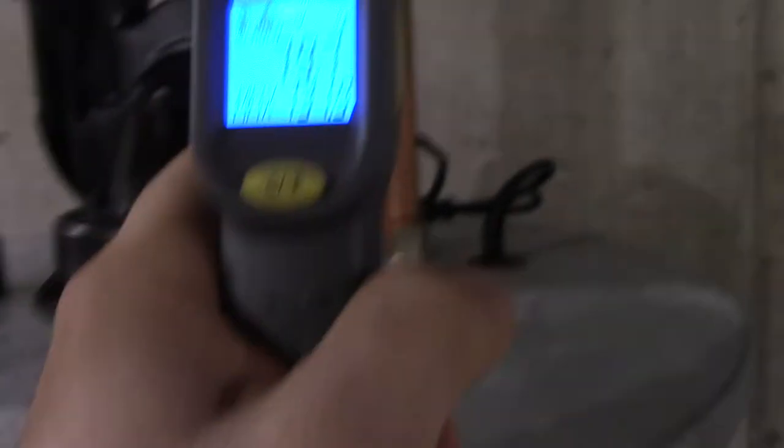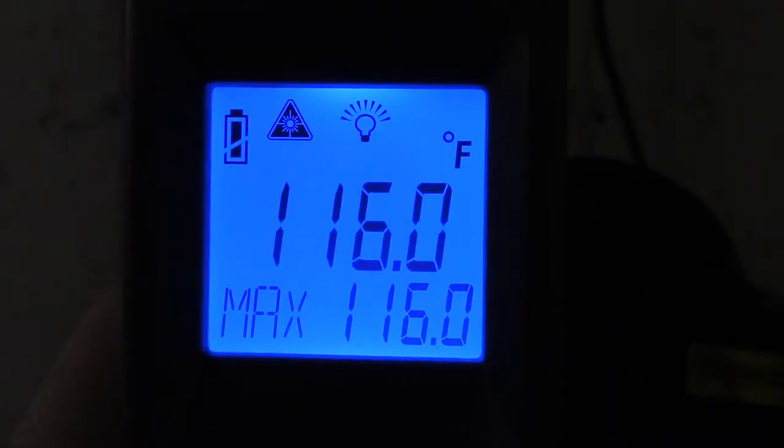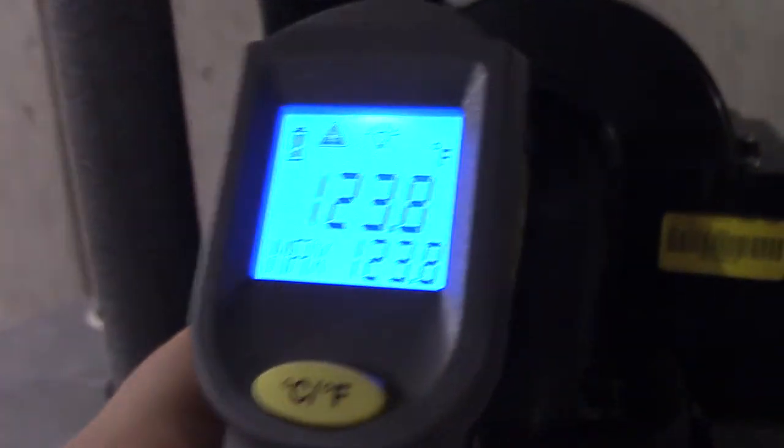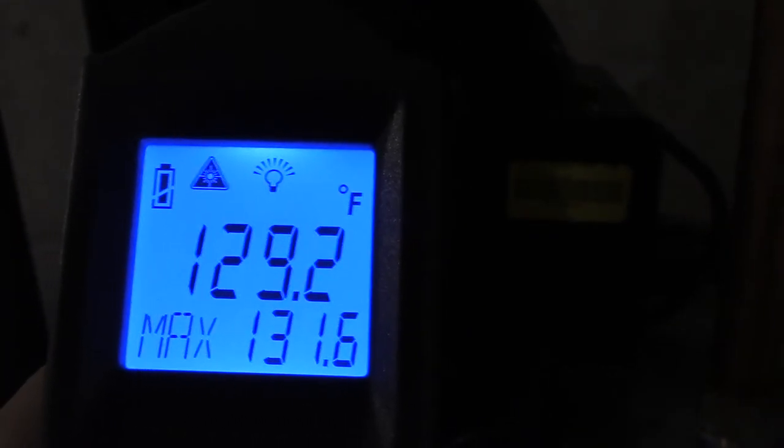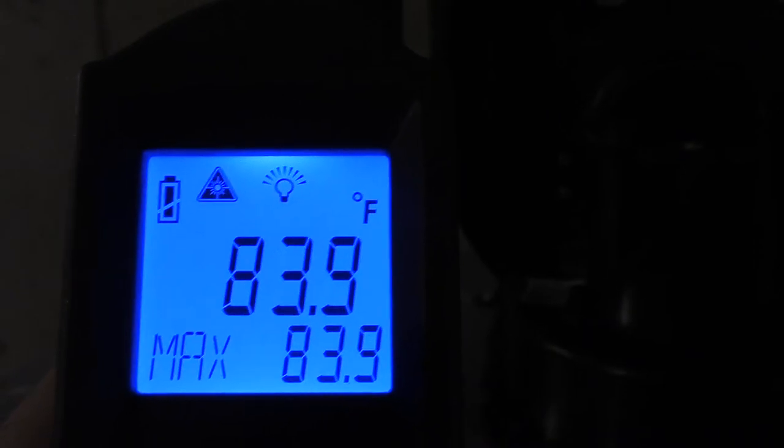Going over to Fahrenheit — the cold water inlet is roughly about 60 degrees, which is pretty normal. You can see it's right on the pipe right there. The exhaust pipe is about 116 — I think 120 is about how hot it usually gets, so that's pretty normal. The top of the exhaust fan is about 130, which is normal because there's an inlet on the back that kind of cools down the exhaust pipe — I'll show you that inlet vent right there. The hot water pipe is about 82 to 83 degrees Fahrenheit. Like I said, the water heater's set to 140, so that insulation's doing a pretty good job.